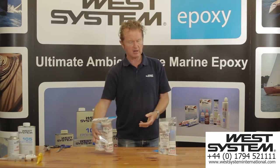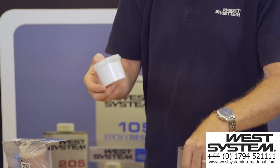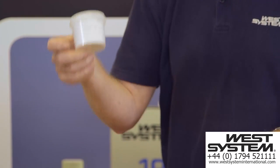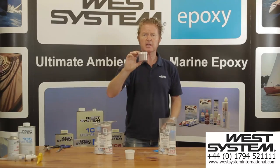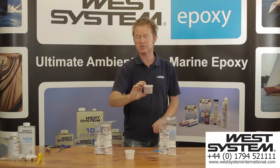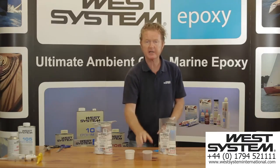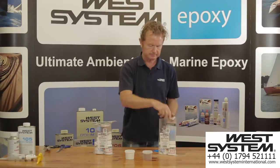The contents are fantastic. Within the pack, you have two fillers. You have the 403 microfibers, perfect for making wood joints, a very high density filler, immensely strong when mixed with West System epoxy. And you also have the low density filler. This is perfect for making a rough surface nice and smooth, in other words, filling it prior to sanding it fair. It's also incredibly good for making lightweight fillets in a small sailing dinghy or small motorboat.